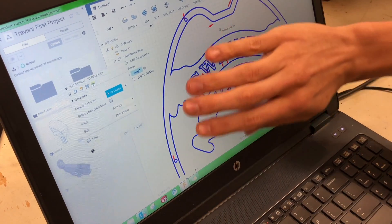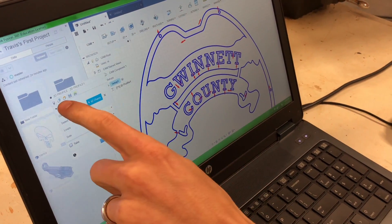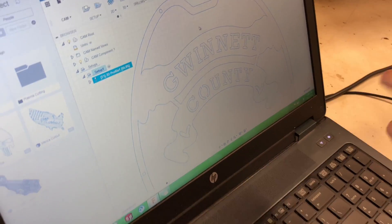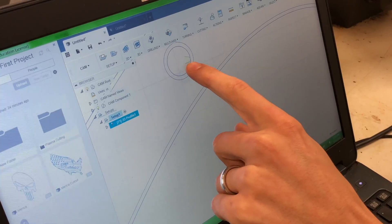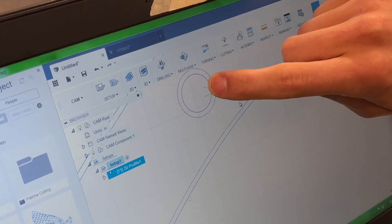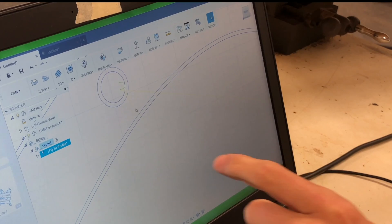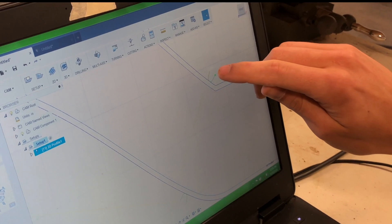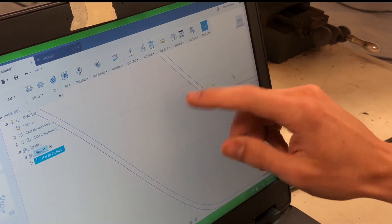I do inside cuts on almost every single thing other than the outside profile. The reason for that — if I zoom into a hole, the green represents where the torch is firing. The torch fires on that dot of the green line, comes into the circle, does the profile, and sweeps out. If you do it on the outside and this is an inner profile, you're going to get a hole on the inside of your edge. You're not going to have a proper lead-in into the part, and your part's going to be messed up.